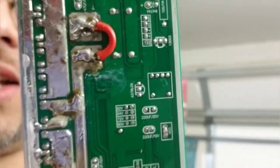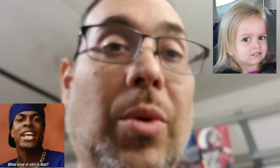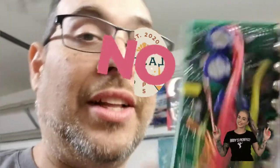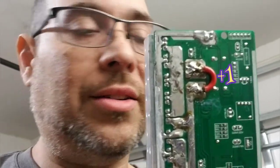On the back side I went ahead and added an additional wire. These little bars in here — what they do is they tell this controller how many amps are going through it. This one is supposed to handle 45 amps and it's got these three bars. Well, I've added basically another bar, so at 60 — even 50 — I'm good, as long as I don't burn out these MOSFETs.